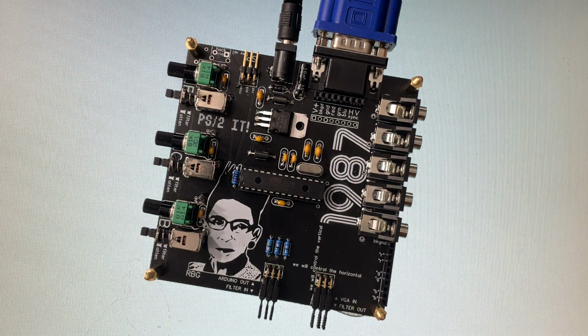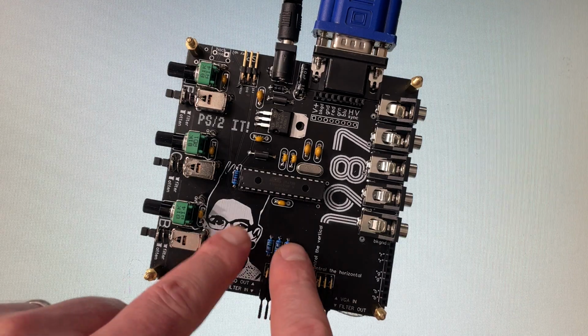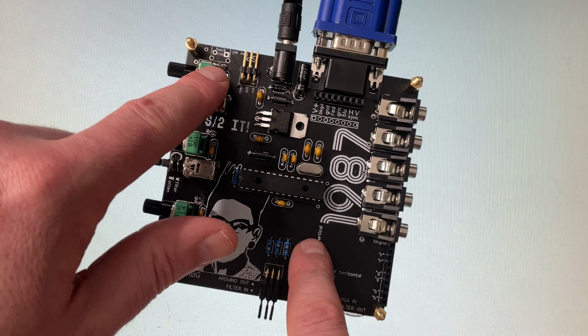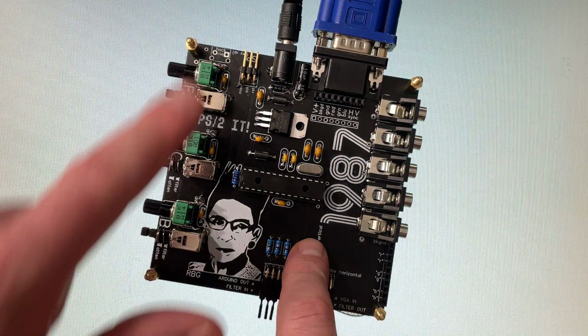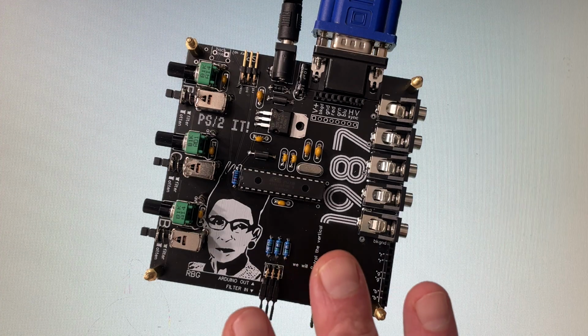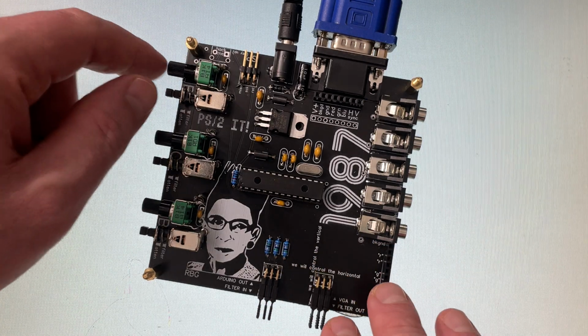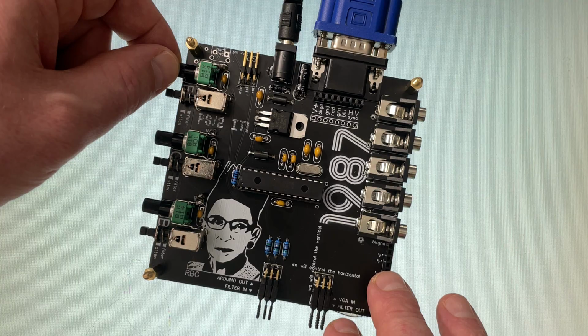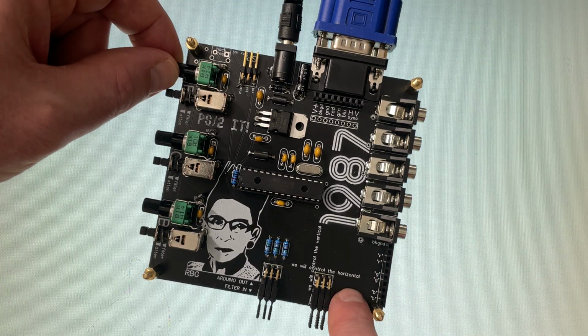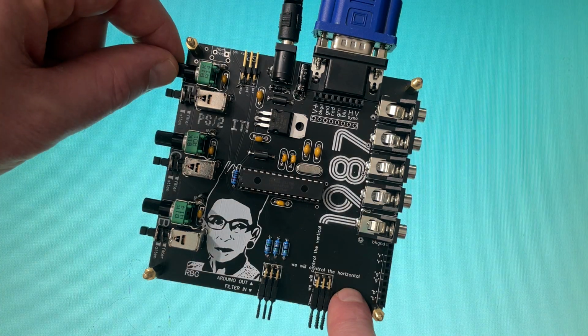This is super useful, having white here. The red, green, and blue pins from the Atmega are going through some attenuators here. We got red, green, and blue attenuators. And what is nice about this is that you can continuously control the background. It's not like a static thing where you switch from one thing to another thing. In order to control the background colors, you can use these attenuators.